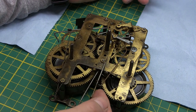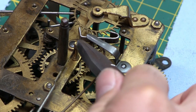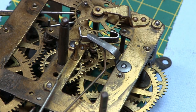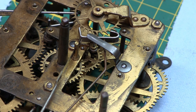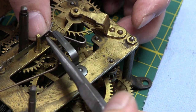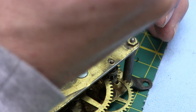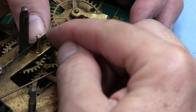The first thing I'm going to do is take out the suspension spring. The suspension spring is here and it goes through this slot in this post. Usually it lifts right out, but if the post is closed it won't lift through. The suspension spring has a little piece of brass in the end of the wire to keep it from slipping through the post. So we just want to bend that out — there's a little hole there, and they just put a piece of wire through and bent it up. We just want to bend that back; sometimes you can use your fingers because the wire is very thin.